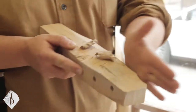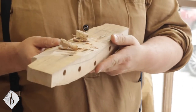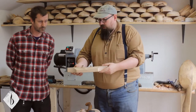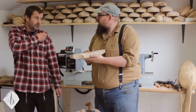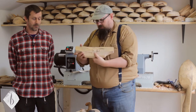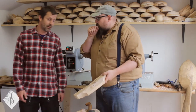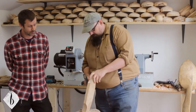You'd probably do that even when it was left square — you'd just do it in that direction. If it was left square you could see the line. Have it pushed into a bench hook, a big vise face if you've got one — a gouge and a mallet. Or even an adze. You can even leave the piece of wood far too long and screw it down onto a plank. There are many ways of holding a piece of wood.